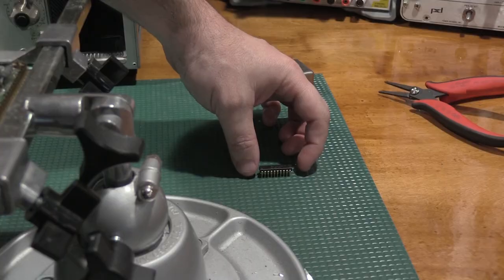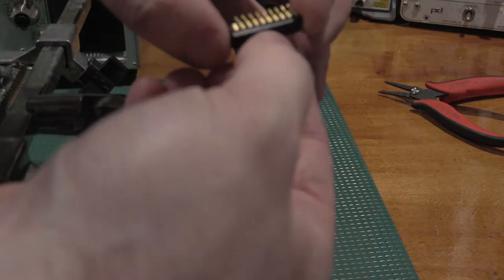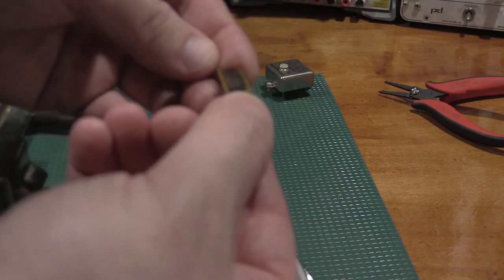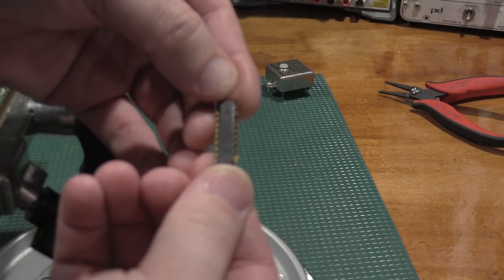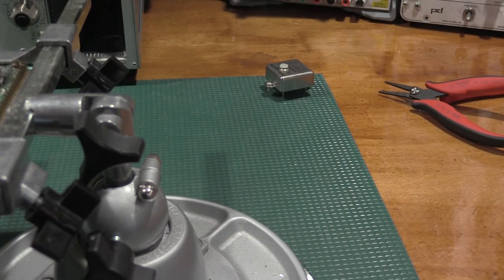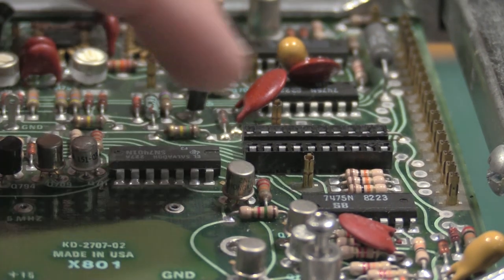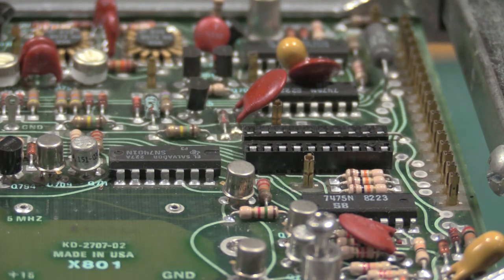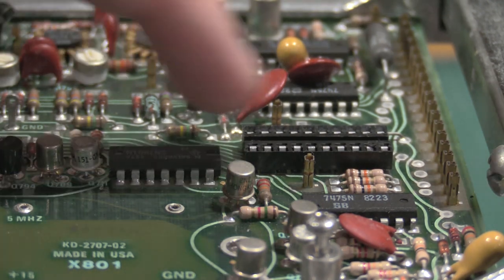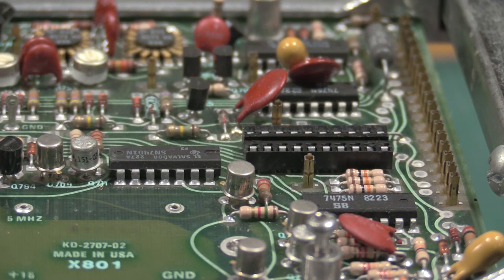and then I'll be back. Well, we have our first major delicate problem. I'm going to have to straighten this pin. I pulled this chip out. This pin was mashed into the socket, so that's not healthy, so I'm going to have to fix that. These are not the TI sockets. They're different, but now that I got the chips out, I'll just touch up the solder joints on these because these aren't the TIs, and then we'll see if the sockets are still good. I may not need them. And then we'll reassemble and see what works.